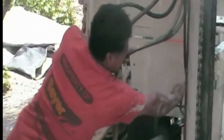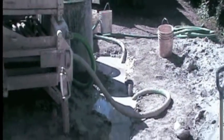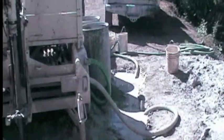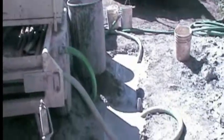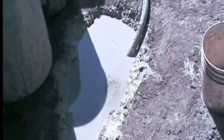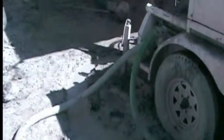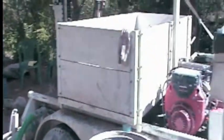This is my friend working the controls of a very small trailer rig that we used. Here it is drilling to 50 meters with a 9.5 inch tricone bit — a little bit larger bit for this project because of the 6 inch casing. The machine held up well, though it was just a challenge.